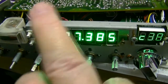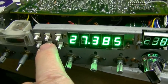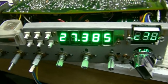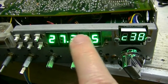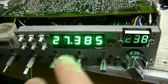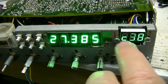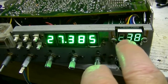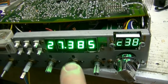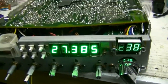It's going to be your amp control. This is going to be CSF. Noise blanker will be on the top, ANL on the bottom. And this is squelch scan up, squelch scan down. That's the way they're going to be. I also need to put a resistor in the line to dim it down some — it's much brighter than the old ones. I need to get it dimmed down to where it's about the same brightness as the channel selector, because right now it's too bright — it'll light up a room.